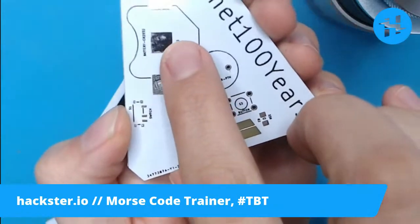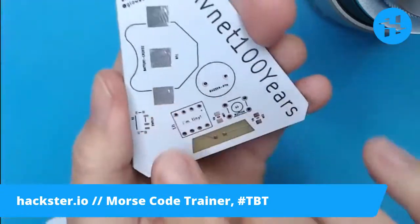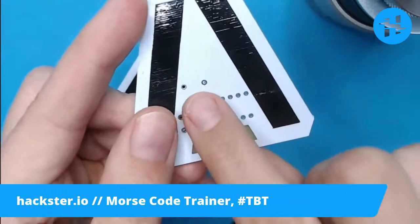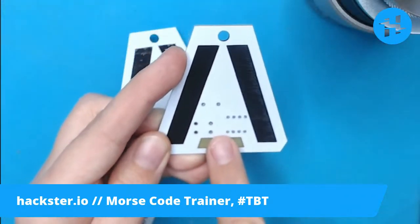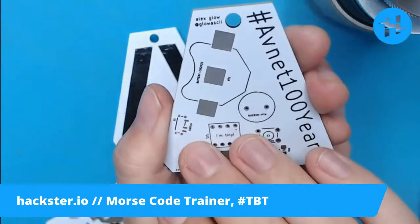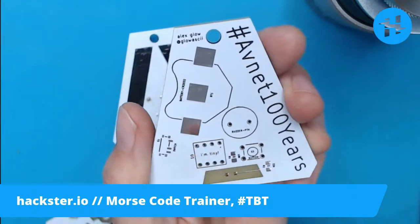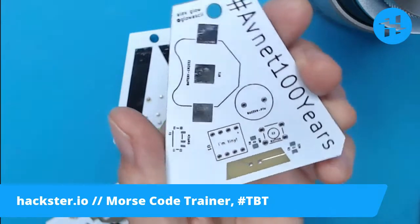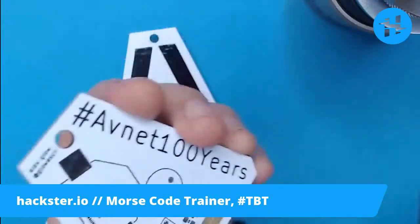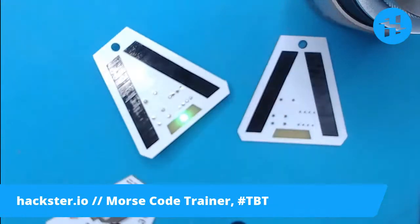You can see that ground connection isn't wired to anything on the top or on the bottom - so embarrassing! That's partly because I was shifting things around in order to try and get these to be centered nicely, vaguely nicely, in the Avnet logo, so they look as low-key as possible. And while I was shifting those things around, after I had already gotten it all routed, I must have forgotten to reroute that back to the ground pin. So frustrating! I made my own personal tiny footprint for this, and you can see the whole thing on the project.